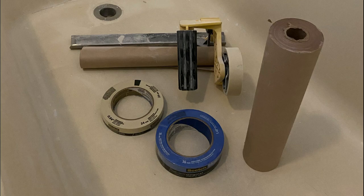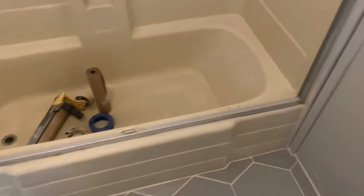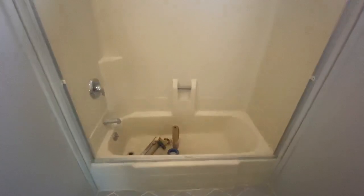Here you see I've got inch and a half blue painter's tape, I've got one inch masking tape, I've got a hand masker, and I've got 12 inch by 60 yard masking paper. I'm going to be showing you masking and taping around the perimeter of the tub shower unit, the shower tracks and rails, and the fixtures.